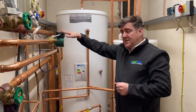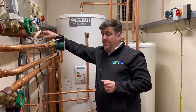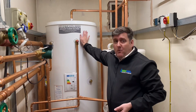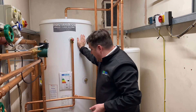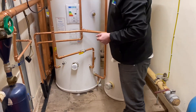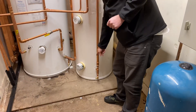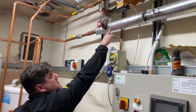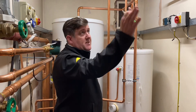So those boilers downstairs that we've seen are now feeding up here, and the shunt pump — the new one — is pumping the water back up here. What we've done now is we've got a 500 litre tank. The cold comes in at the bottom as normal, and as it comes back out instead of going back to hot water, it comes back into the bottom of this one, back up and out and continues on to its original route. As it stands now we've got 700 litres of stored hot water plus what's in the pipework.